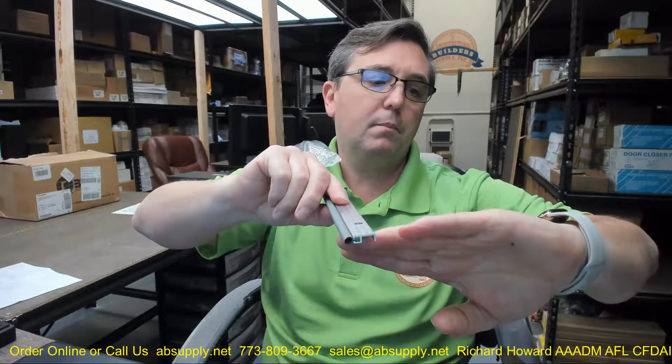This would be very nice to use as perimeter gasketing not only on doors but on windows. I have people who will call and say they've got a restaurant where in the winter they close up all the windows but in the summer they open them, and they need a way to seal that. You can run this material around all four sides and not only seal it but permit it to act as a stop as well. You can really elegantly just push against this vinyl.